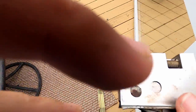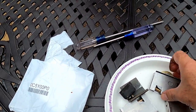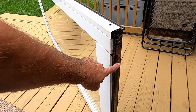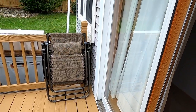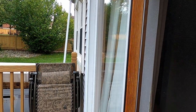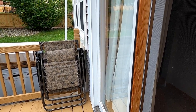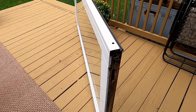I'm going to adjust the new roller to match the depth of the old roller, then simply put those assemblies back in and stand the door back up on the frame and screw the brackets and parts back in. Once I looked at it, I realized it's only six Phillips screws — that's it — and then the door comes right off and the roller assemblies come right out.